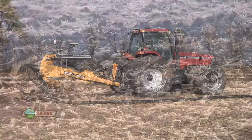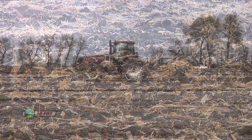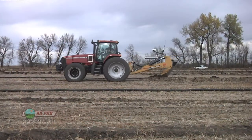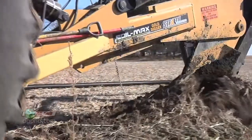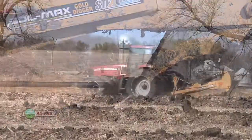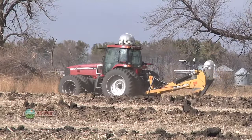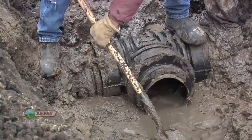This is one other area where we see spots in the field like that and we see surface inlets. We're not a big fan of surface inlets. You can do the same type of job by just putting your tile spacings more closely together. So in a low spot like that, we may have tile spacings every 15 feet just to try and do a better job of getting that water moved out quickly in those lower areas where it's really tough to get rid of water.